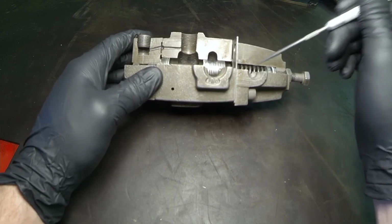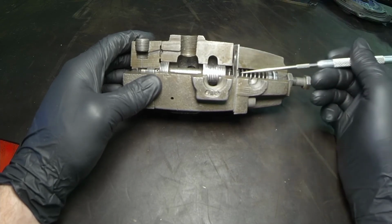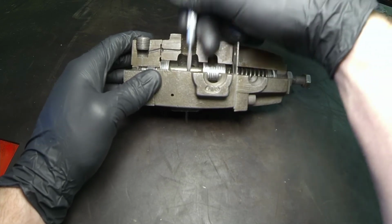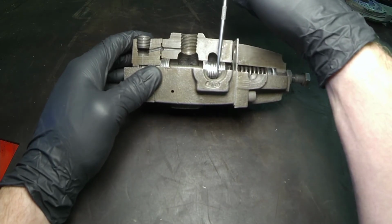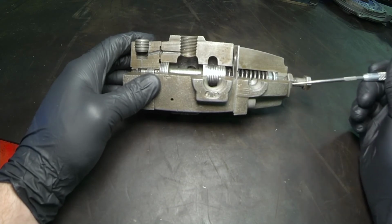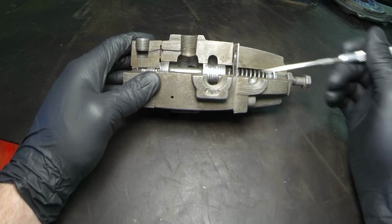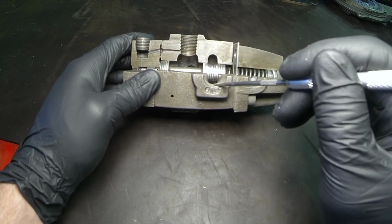If that's not there, any leakage in the spool will actually get into the spring cavity and it'll be pressure plus spring holding this spool, sending only the pressure to one function, and you will not get the use of the second function. So one thing we also need to see right here is that this sequence valve is adjustable. And the adjustability you're changing using this lock nut and the adjusting screw, what you're actually changing is the pressure at which the second function starts.